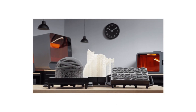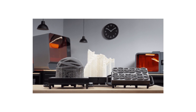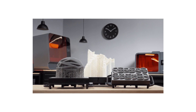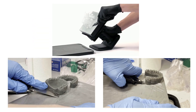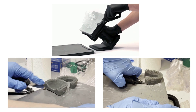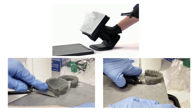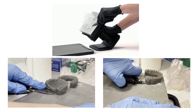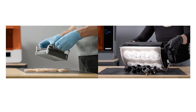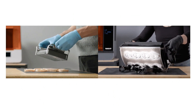After washing, parts should be left to thoroughly dry before moving on to post-curing. You can leave parts on the build platform to dry or remove them. Parts can be removed using the part removal tool, the scraper, the flush cutters, or a combination of tools. Use the build platform jig to hold your build platform steady and always point and push sharp tools away from your body. Having the Build Platform 2 or 2L will allow you to easily pop off your parts onto your workspace.